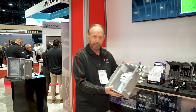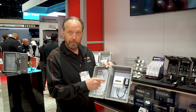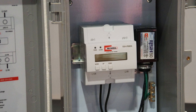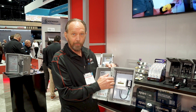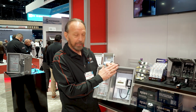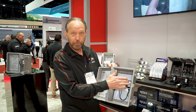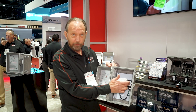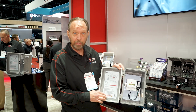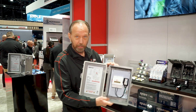We've taken those two technologies and put them in a NEMA 3R weatherproof enclosure — a single enclosure with high voltage, low voltage, and surge protection. It's all modular; these are off-the-shelf devices. If they ever need to be replaced, you don't take the housing off or send the backplane back — all you do is replace these units. Lifetime product replacement warranty on the surge protector, three-year on the monitor. All the programming instructions for high voltage and low voltage are inside the door. Single solution in one enclosure.